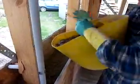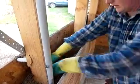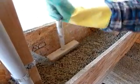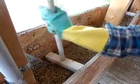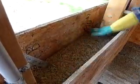Using the flexible bucket, we pour the mix into the formwork — the flexible buckets make it easier to squeeze them into the right shape. We even it out ready for tamping; the layer is about five centimeters thick. Using the tamper, we tamp along the edges first and then back across the middle, taking extra care around the studs and any penetrations through the wall.